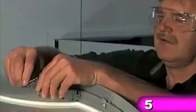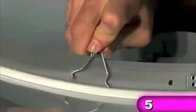Topo panels are designed to slip over the tee easily, yet have sufficient grip to keep the panel edges in place. However, in some cases, panel hold-down clips may also be necessary to create a tight fit between the panels and the grid. By snapping a panel hold-down clip over the bulb of the common tee between 2 panels, the clip keeps 2 adjacent panels pressed tightly to the grid. Panel hold-down clips should be installed after 2 adjacent panels have been laid in place.